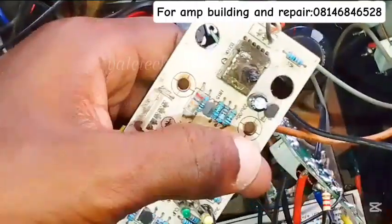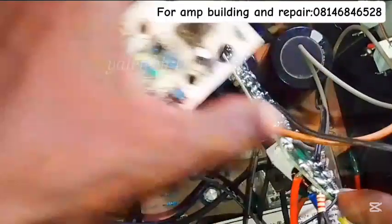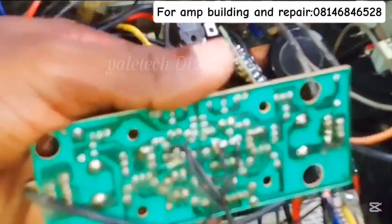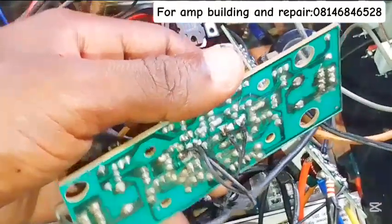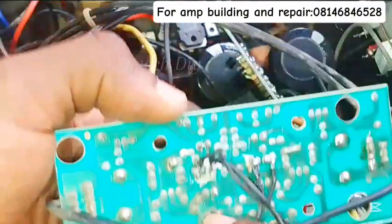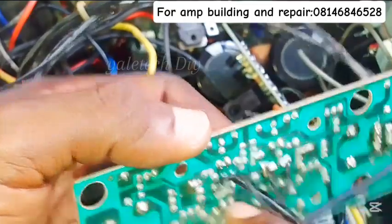That's just it — that's the way it works. Pick the signal from the positive side of the main speaker out, then ground to the ground. Just send it to the bulb, but ensure you peel the bulb wires so the signal doesn't go somewhere else. Remember we've adapted this to our own use, not what it was originally designed for. For the second channel, the same thing is applicable.